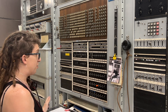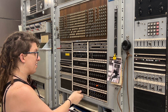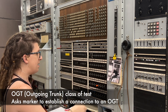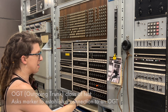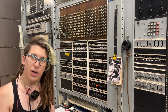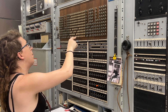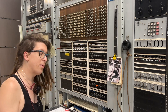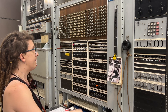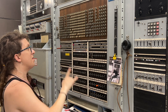We can also test trunks, which is something I do a lot on this panel. We can test different kinds of trunks — for instance, outgoing trunks. To do that we need to select a completing marker; in our machines that's marker zero and marker one, so let's use marker one. We do outgoing trunk and give the machine a code — let's try 832-0010, which is a phone over in the number one crossbar. It gave us an error: trunk busy, TB. So this was not a successful test.